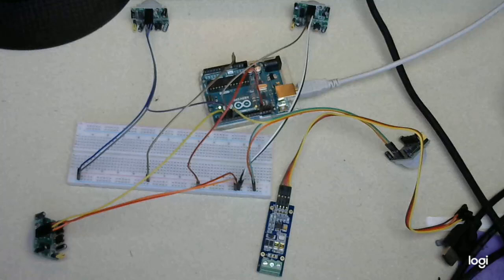I've had some projects where I did overdrive it, and what would happen is the Arduino would reset itself when its current draw would get below what could be handled. And when that becomes an issue, then the trick is to run an external power supply for these devices and just have the control line going in. And you have to get a little squirrely with the COM lines, the negative line, but nothing that you can't work around. So that's not going to be an issue on these devices. So the next video is I'll start playing with that TTL to RS-485 and see if I can get that to talk. Well, have fun, guys.